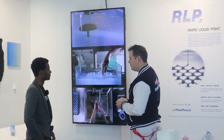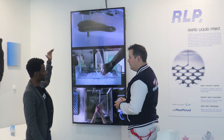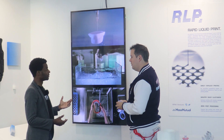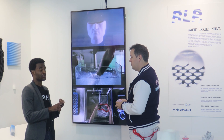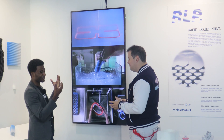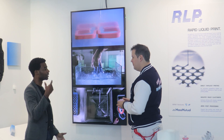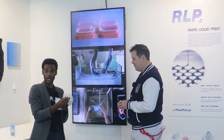So we've been developing this since 2015 and the reality is that we're creating a platform where you can go from a design to print, to just washing your part, to a finished product in just minutes instead of taking weeks or months that it takes by traditional manufacturing. Ultimately we're eliminating the need for a mold to be created for silicone or elastomer products. We're also reducing the print time because we don't have to do supports and we don't have to do a layer-by-layer approach anymore. Because we're printing in this gel, it eliminates the effects of gravity, so ultimately we can have the freedom to draw in 3D space — almost like calligraphy in 3D space — which allows us to do really flexible, unique, even impossible-to-make-any-other-way products.